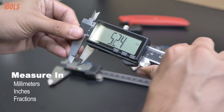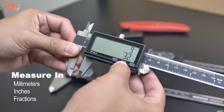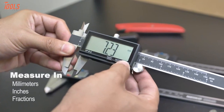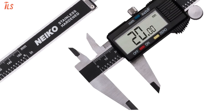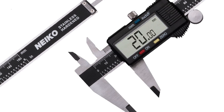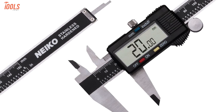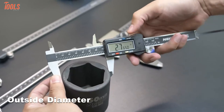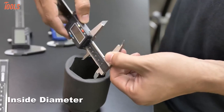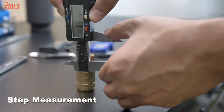It comes with a multifunctional measuring system and a quick-change button to switch between inch, fraction, and millimeter modes, so you can get various kinds of measurements based on your requirements. It has a measuring range between 0 and 6 inches with an accuracy of 0.02 millimeters. With two sets of stainless jaws in a probe, it comes with four ultimate measuring capabilities: inside, outside, depth, and step — meaning you can do any kind of measuring with this single tool.